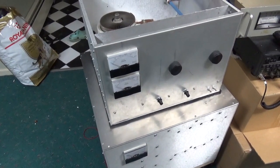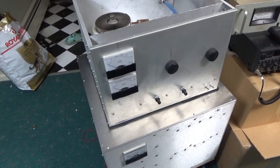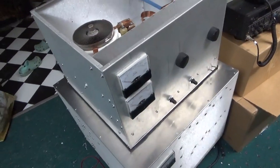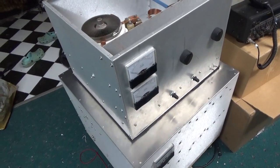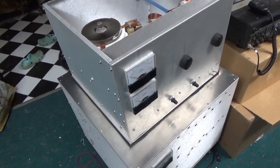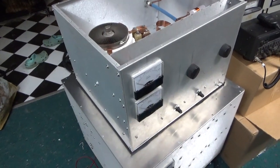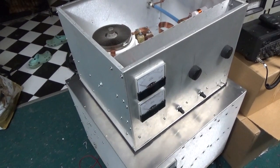For a split second, they have a 26-volt coil — they switch at 70 volts, like 71 volts, and then it drops right down. Something I noticed: as I kept the amplifier keyed — this was just a dry key, no high voltage, no RF, nothing — I took a measurement at one of the coils, and the longer it was keyed, the higher the voltage would creep.